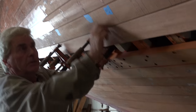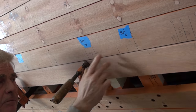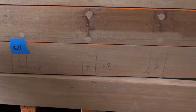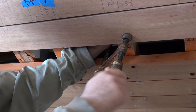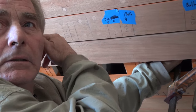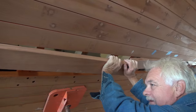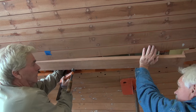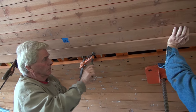So you see the distances — they're about an eighth or so. That's what we just developed in here. Tight on the inside, coming out to about an eighth. Then we'll have to wedge this up. If you see a caulking bevel that big on a boat this size — oh, that's too big. Something's wrong with that. You see how we're clamping towards the bottom edge because the plank's twisting in this way. That's what that's all about.